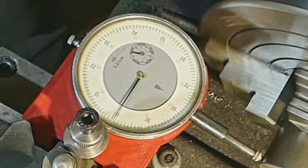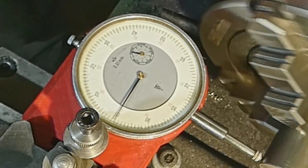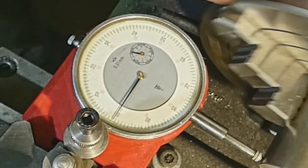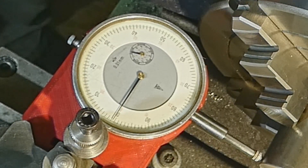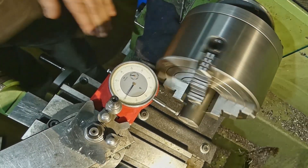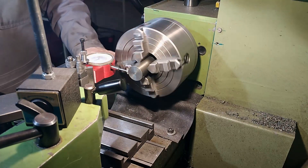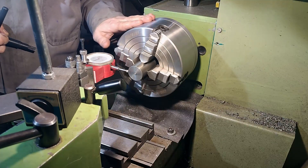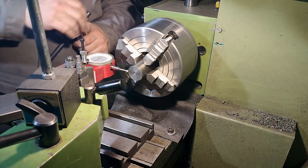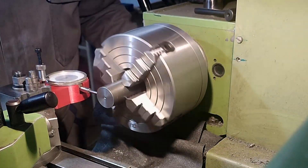This is probably the best we can get — one hundredth or one and a half hundredths — because this is not precision-ground stock. In most jobs this must be enough. If you have precision-ground or previously turned stock you can get it practically to zero. This method has proven to be very useful and simple to me. I hope this video helps someone who struggled with their four-jaw chuck like I did. Thank you for watching — feel free to comment, and if you like the video, share and subscribe to my channel.